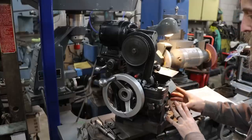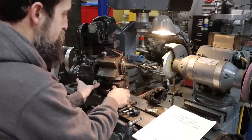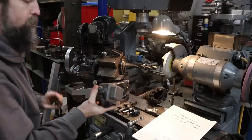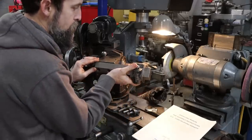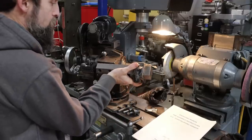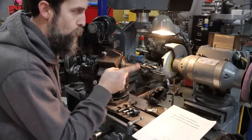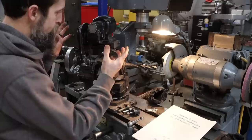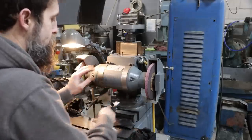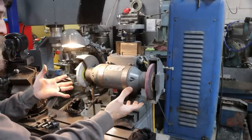Down on the bottom part of the carriage there's a spring-loaded section with rollers — it's all a super-precision instrument. It's got a V-block and a tailstock that bolts on and is adjustable so you can support longer work centered on both ends. The grinder head itself, although it looks like something you'd see on a standard bench grinder, is far from that — it's a precision dual-wheeled spindle that takes the same hubs as my cutter grinder, so I can swap wheels between machines.